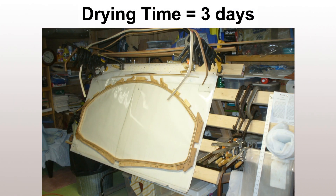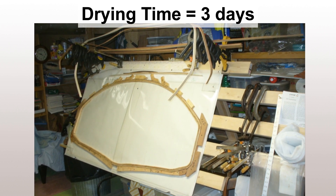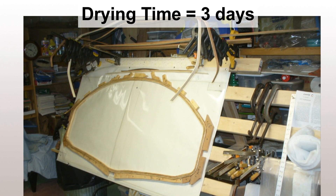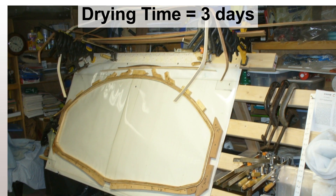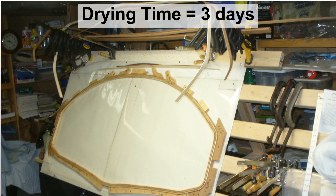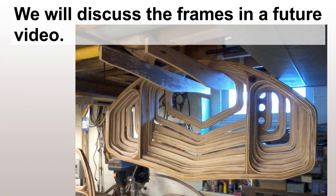As you can see in some of the illustrations, I created this easel which I re-lofted the shape of the frame on and then placed blocks on the exterior edge of the frame that the wood was then steamed and pressed into and clamped. Those above the easel are two pieces that are drying, with a furnace duct right above blowing warmer air down onto those pieces of wood. It took a period of two winters to make the 24 frames that are in this boat.